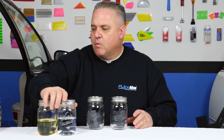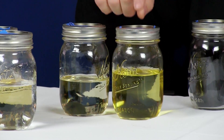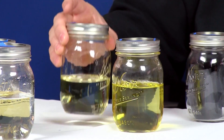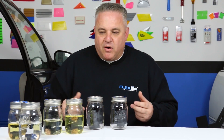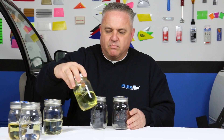Let's also introduce a couple more chemicals. This jar contains a UV inhibitor. UV inhibitors in our window film can live in the polyester, in the glues, and also inside the hard coating. Just like sunscreen protects our skin at the beach, UV inhibitors protect our raw materials — the dye, the polyester, the adhesives. We also benefit from UV protection for our customers, which we can market. The UV inhibitor is very critical to the construction of our window film.